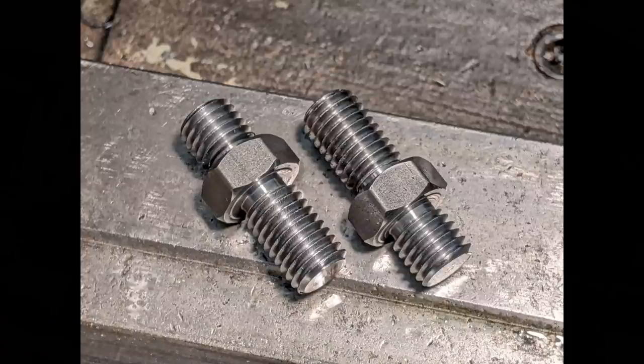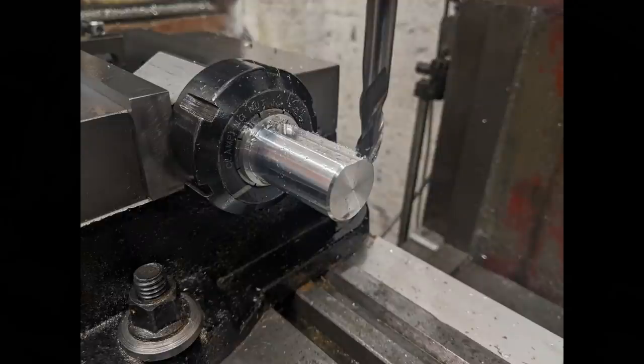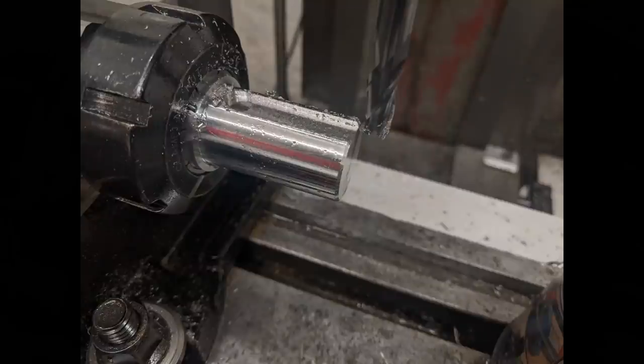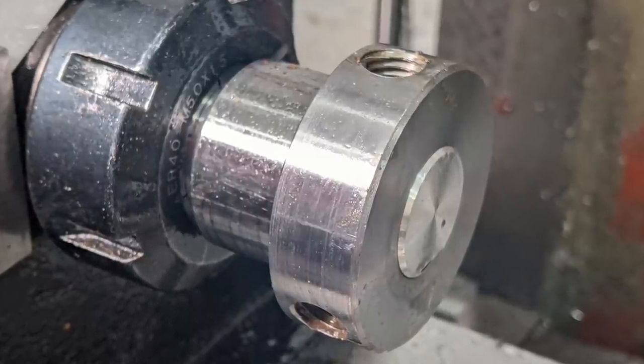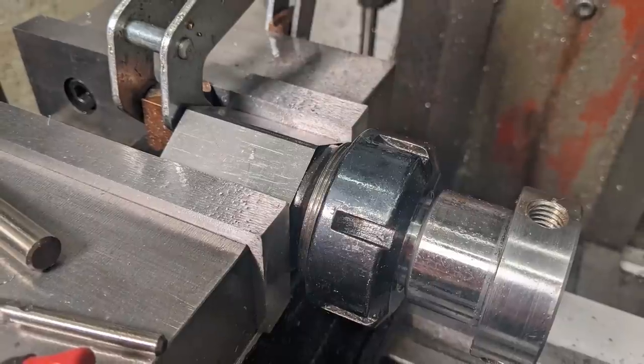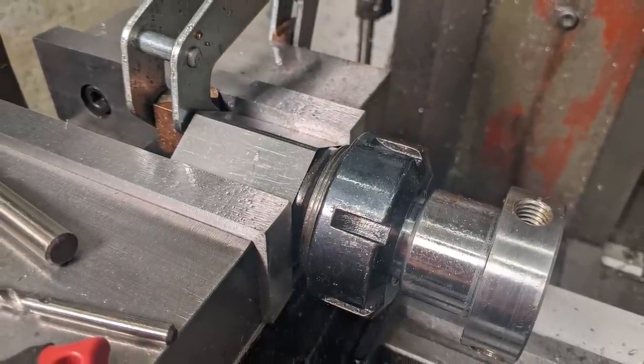Right, that's all the studs, washers and nuts finished, so now it's time to drill and tap the sliding collars to take those studs. I'm using a sacrificial mandrel to hold the collar for the drilling and tapping. It's got a mill groove for the grub screws to tighten into and a 30mm spigot which fits into an ER40 hex collet block, so I can make the three M12 tapped holes at 120 degree intervals. I'll use a clamp as an end stop for the collet block, as this is a new vise and I haven't made a proper set of stops for it yet.